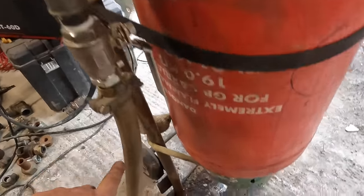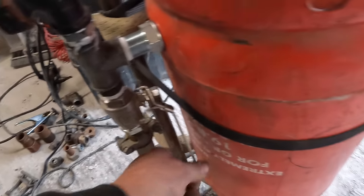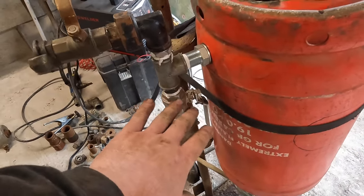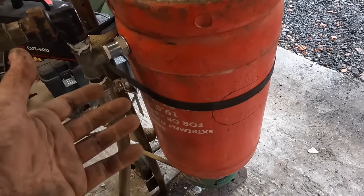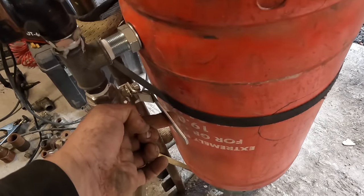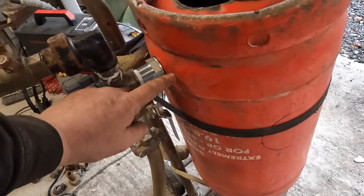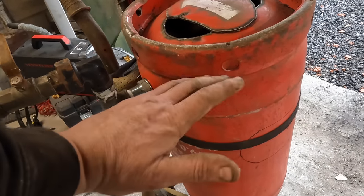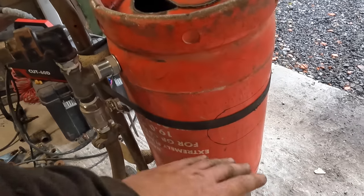So it goes in here, goes down to the blast pot. So this is your choke valve. So if you're having bother with any sort of media inside here, that's not naturally open. Leave that open at all times. It's only if you've got a cloggage, a bit of damp media or whatever, while the blaster's running, you can just run that up and then put that back down again. And then what that does is all air coming in goes straight into the top of the pot and pushes whatever's in the way, providing it's getting sieved. It'll only be a bit of cardboard or crap, as long as you sieve it. So it'll go through that way.